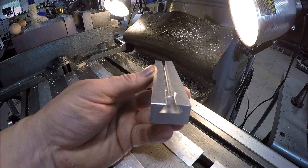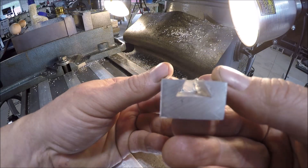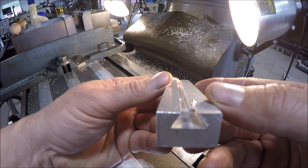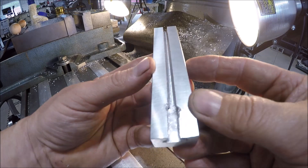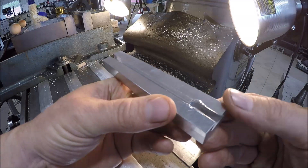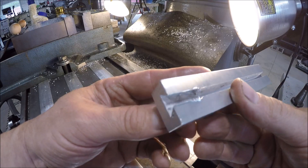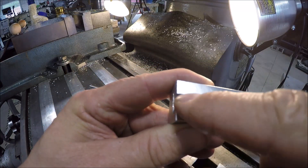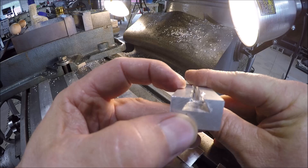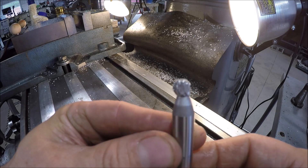I dug out the broken bits and I'm surveying what's going on. I was running about 2200 RPM and had the table feed at the slowest setting. She was chugging along okay until she got in there, and I don't know if it was starting to get warm and that caused the welding. It's still salvageable for what we're going to do — I'll just clean the burrs up. But I've got to figure out how not to do this again. And then of course, who knew I could make my own rotary burrs! Oh well, sometimes you just gotta laugh.